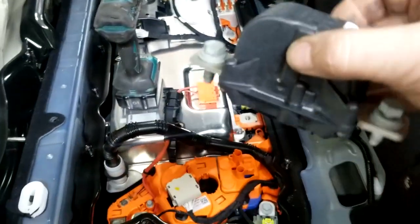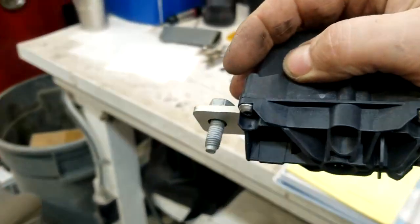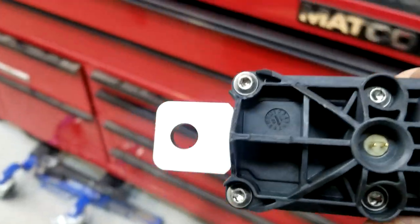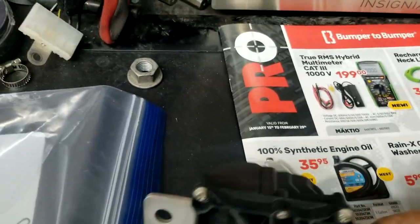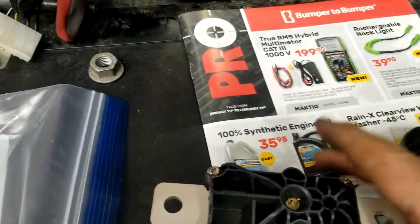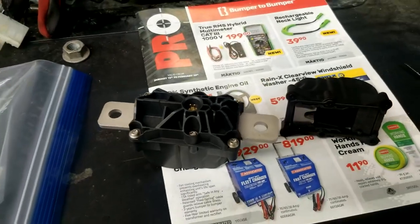There's no power to this thing when it's off, but yeah, that's the power fuse — looks like that. Those are the connectors for the charger right here. I have one that's been blown: it's the cavity where the bus bar goes in, and it gets blown apart. This piece here basically gets sheared in half inside, opening all current to the vehicle, and then the vehicle basically shuts down at that point.